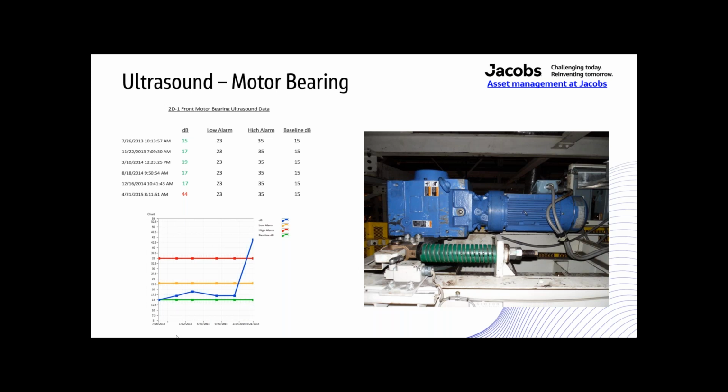drive assembly. So this drive unit is factory assembled and is not made for parts replacements, like replacing the motor in the field. So having all the data that vibration analysis could have provided wouldn't have been a benefit, really, because you have to replace the whole unit.